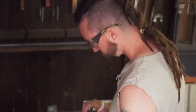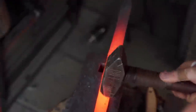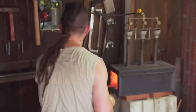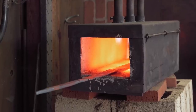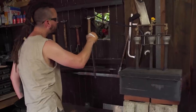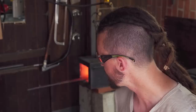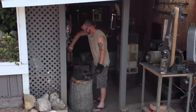Day three. I have to finish this blade. I gotta get it heat treated. I gotta get as much of that done today as possible. No, I gotta get all of that done today. As I'm forging this thing out, I'm just about done. I'm straightening it, and I notice that it's not quite getting as hot. The propane's running out. It's just slowly dropping. It's not very easy to go fill this tank. At this point, I am running out of time, so I'm not gonna quench today because I won't be able to get the blade hot enough. So I'm gonna just wait it out until I have the propane, get the even heat that I need, because there's zero room for error.